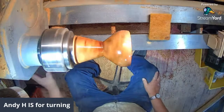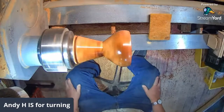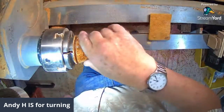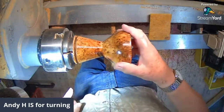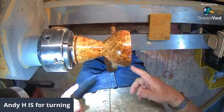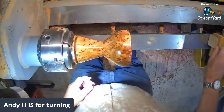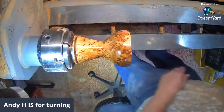Shellac flakes are readily available on eBay and I believe Amazon does them now as well. That's lovely. So if I pop that off now and buff it - because it will have hardened by then - with the buffing system, we will have a completely finished piece, apart from the base, which I can do because that's very simple. It'll be nice, won't it? First time - got to do it now and again just to prove I can.